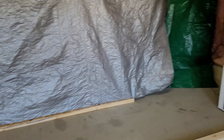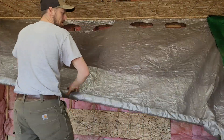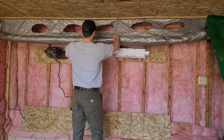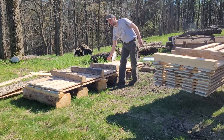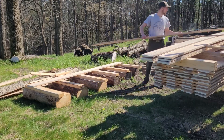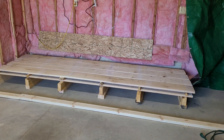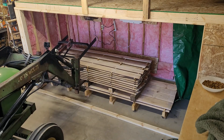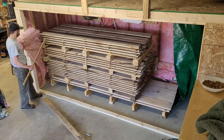I think I'm about ready for a bunk of lumber. Off the side I have a tarp that goes back to the corner, so I'll have a little bit more room up here for the heater and the dehumidifier. I have a strip of wood grooved in the bottom of the tarp, so when I'm putting lumber in and out, I can just roll it up and put it out of the way. I have to hand-load all these 10-foot boards because they won't fit through the 9-foot garage door — design flaw. The fans on the back wall blow air down and push the warm air through the bunks of lumber. The tarps help keep the air moving in a circular pattern so there's always air moving across the lumber.